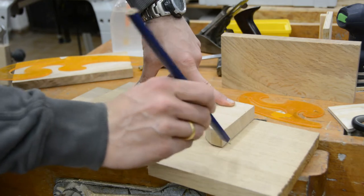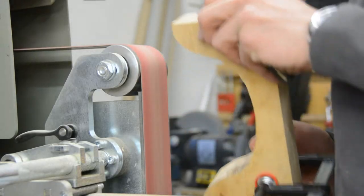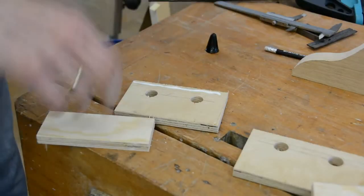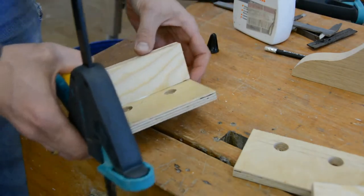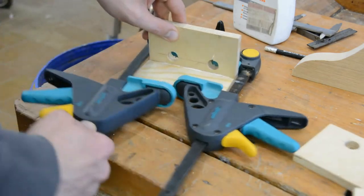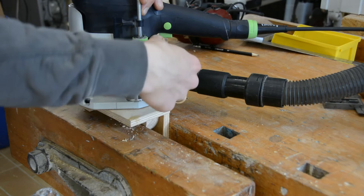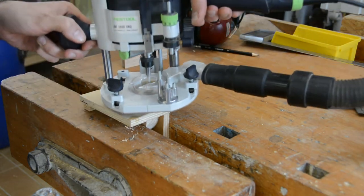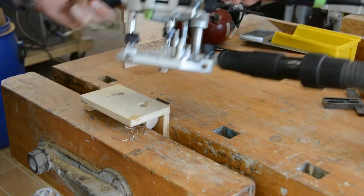The supports for the smaller shelves are made from one piece of wood — I cut them to size and sand them smooth. You could drill the two holes to put the shelves in place with a drill directly, but I prefer to drill two holes in the size of the guide bushing of my router in a template, so I can clamp that to the sides and drill the holes perfectly perpendicular and to the precise depth with my router.